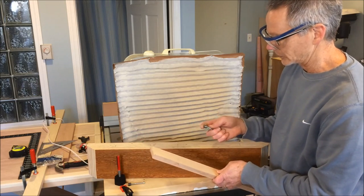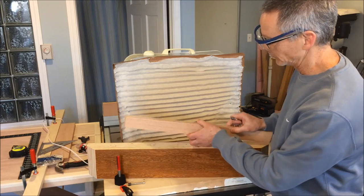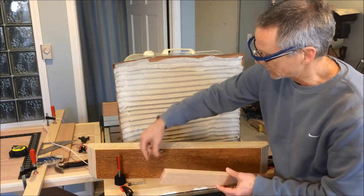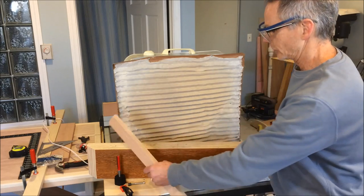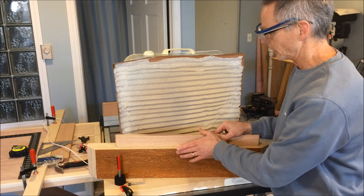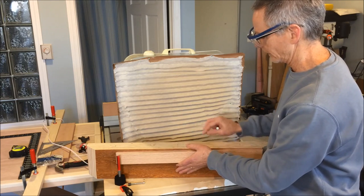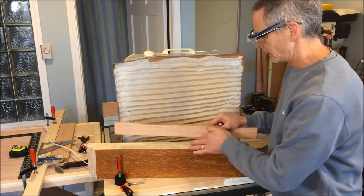I've got some 1/4-20 threaded inserts I'm going to embed into the oak, and then once that's slotted over here, I'll just add a couple 1/4-20 bolts, and I'll use those to set this guy up and down. So normally this thing will just sit flush inside of here, and then if I need to adjust it up, I can use them as a stop.